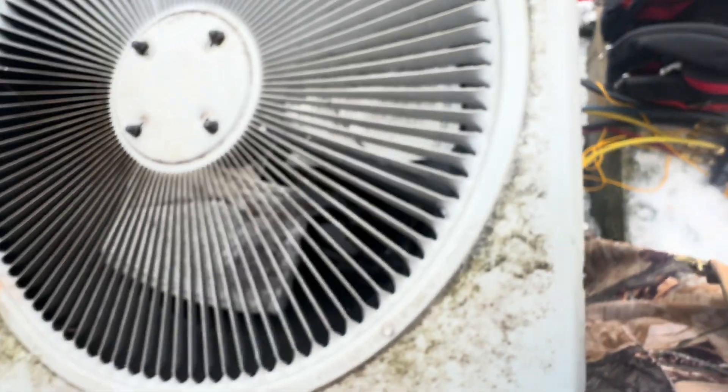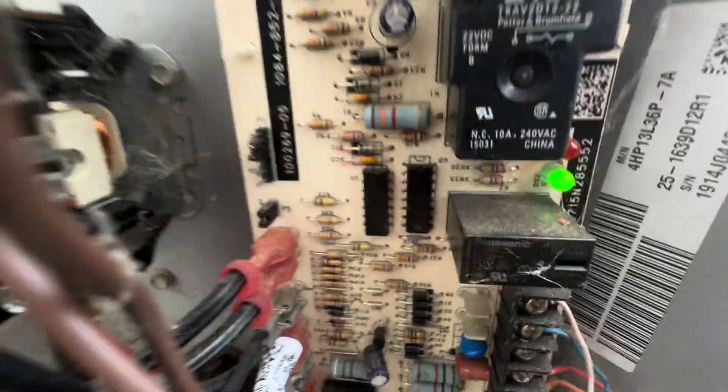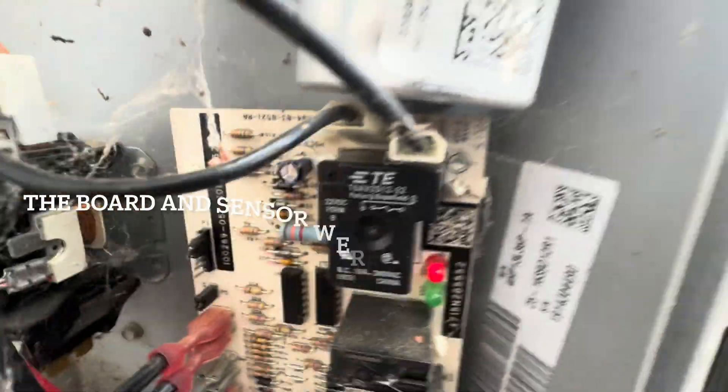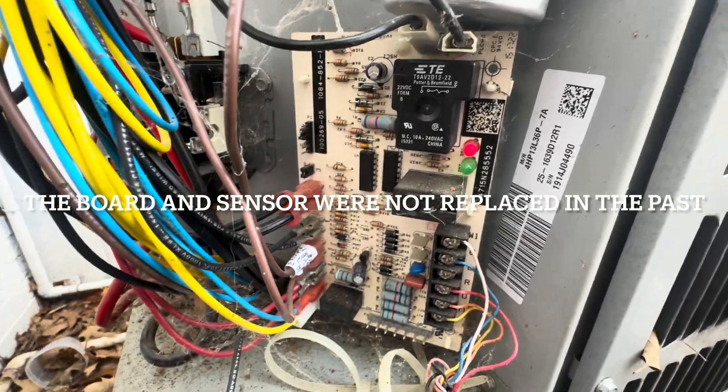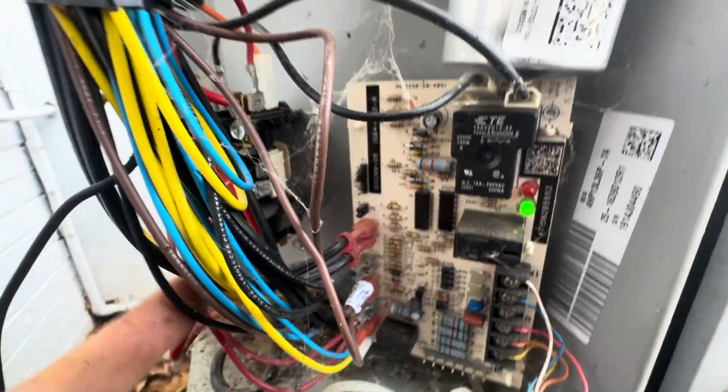That thing is off balance. I don't know if you can tell how much that joker's shaking, but she is. All right, there's the culprit — got a bunch of ice built up on the fans. Once we get that off we can never get it off without hot water. The unit kicked out with a trouble code: coil sensor problem. Replace that coil sensor — and I believe it was just replaced a year or two ago.